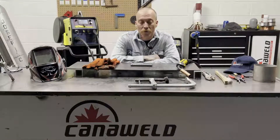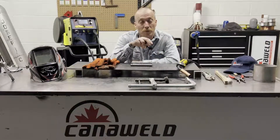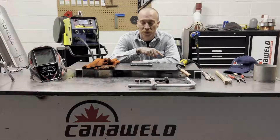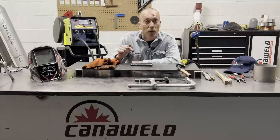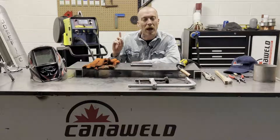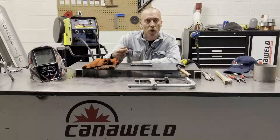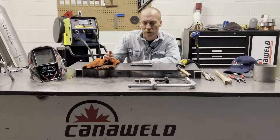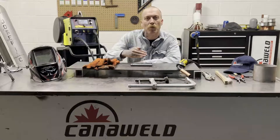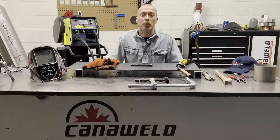So that wraps it up for our first video on the Multi-Process 201 SLM. Today was the MIG welding portion. Next week we're going to film some stick, and then we're going to film some TIG with it. I'm satisfied with the way my MIG weld went today — I thought the machine balanced it really nicely, although I find it did balance it for a guy who moves a bit quicker than me. I got a little bit of pile up, so next time I might turn it down by maybe a factor of 5 on the wire speed to get a bit more flatness. But all in all, awesome — came out great and I'm really happy with it.